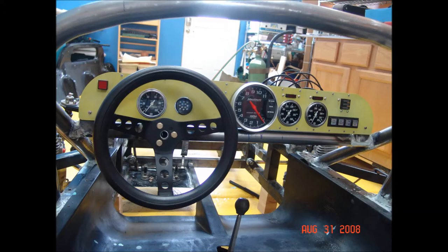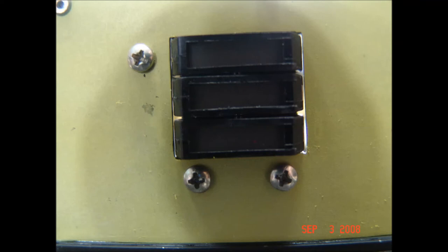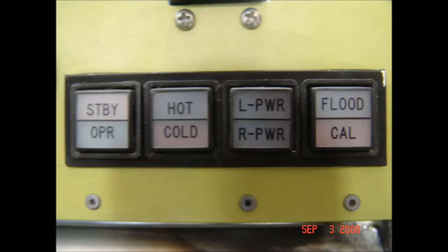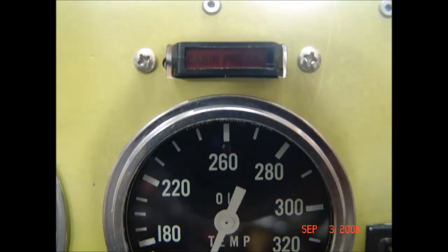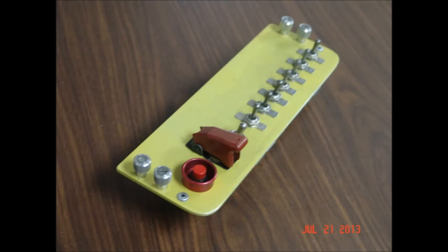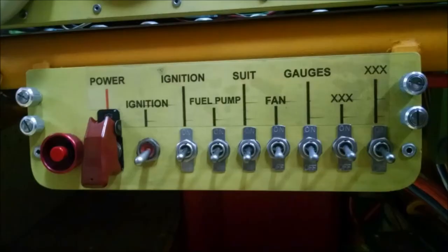Here's what the instrument panel looks like mounted in the front, and here is the rear. For indicators I used roto-tail lights, lighted from the rear through a legend — to change the bulbs you just rotate it around so you don't need to get to the back of the panel. The rest are nice little aerospace indicators with legends changed to something appropriate. The front of the circuit breaker panel has the master electrical off switch as well as the starter button, with legends added.